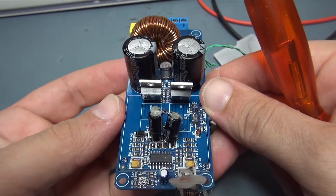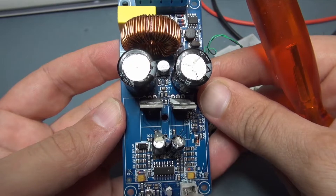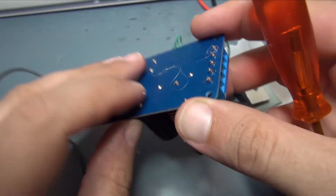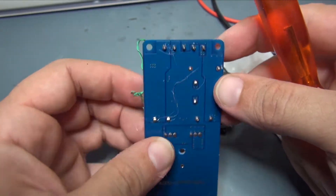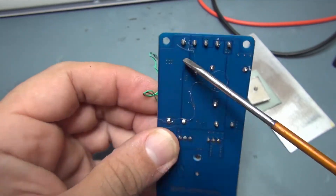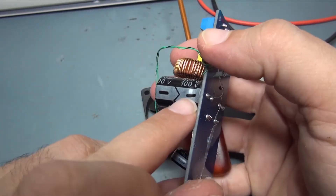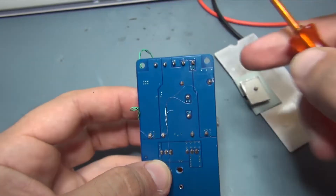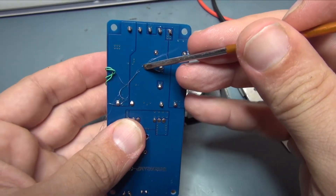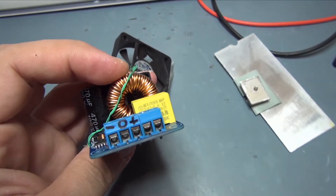I used some logic to connect the wires on this amplifier, but I finally made a mistake. There is no inscription on the PCB about polarities and ground. I just looked at the polarity of the decoupling capacitors and put some marks, but it was too late. This connector goes to the minus of the capacitors, and on the other side the tracks go to the positive. The middle track is simply the ground, which needs to be connected to the middle point.